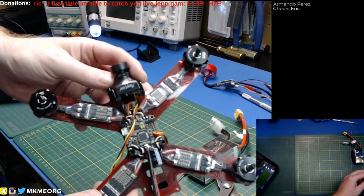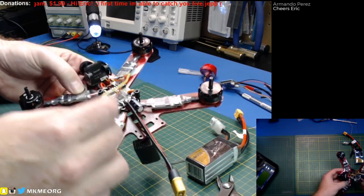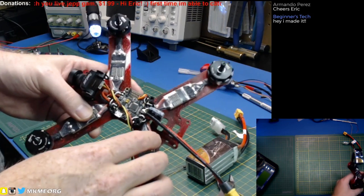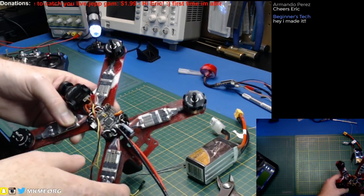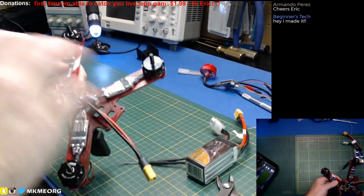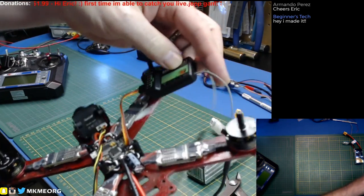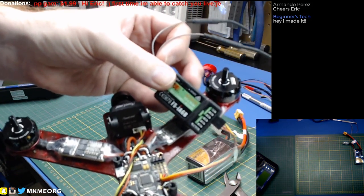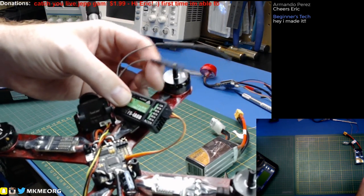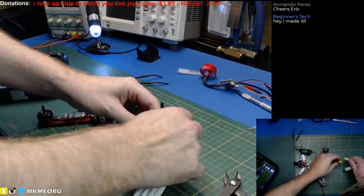I made some time to finish off some more work on the quad. I got the RunCam installed — well, just set on there — and I went ahead and soldered a capacitor on my battery lead. I don't know whether I believe the hype that it's truly necessary, it can't hurt. I got that done the other night. The frame is right where we left it. I hooked up my receiver, this is the FlySky FSi6B telemetry-enabled receiver. Some of them the RSSI doesn't work because the firmware wasn't the newest version — this is one I tested and the firmware works and I have RSSI on my transmitter. I went ahead and flashed it with the newest Betaflight and programmed it, and so far I have to say we're in good shape.